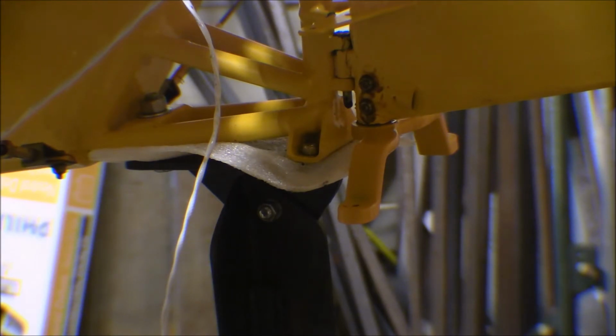Now if anybody has any questions as to which way that fork goes on that rudder, I would think that those ears went forward on it so you'd have more throw on it, because the chain comes back off of that fork back to the tail wheel for the steering, and if it was farther forward you'd have more leverage on it or more stroke on it. But if it's on the forward position, then it runs into the pad there for the tail wheel spring. Well, I ran into that. I wound up having to take that off and turn it around, but it's on there now.